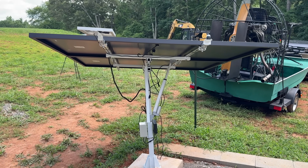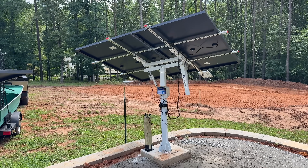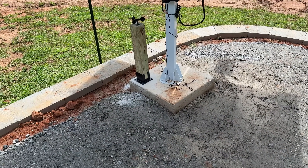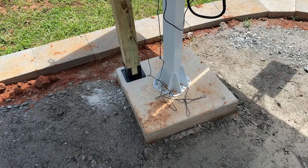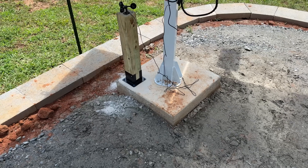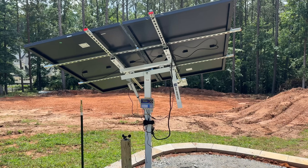I can put this at a much more aggressive angle, which we'll probably do after testing the dual axis tracker. But remember, you are not going to get similar results unless you take your footings seriously. I've seen a lot of people attach these — hopefully temporarily — to some type of pressure-treated stand, and that is not going to give similar results. Here's a quick overview of what it took to set up these footings to give you a solid base for your trackers.